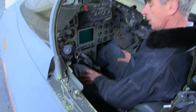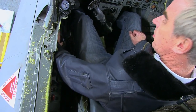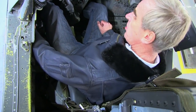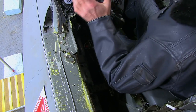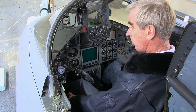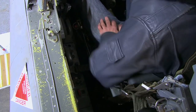The important stuff is over on the left-hand side — the throttles on the left-hand quadrant. Unlike the Phantom where you rocked outboard to get afterburner, on this one you rock outboard and you get thrust reverse — exactly the opposite, which caused a few young Tornado pilots some issues in the early days. The wing sweep lever is on the inboard side operated with a little trigger. Fully forward is 25-degree wing for best rate of turn, then cleared positions at 45, 58, and fully aft at 67 degrees — swept for supersonic and high-speed flight. On the outboard is the flap lever.